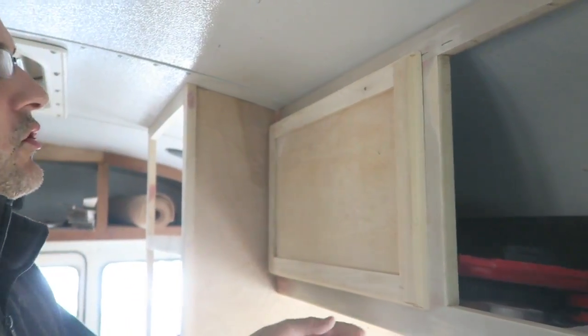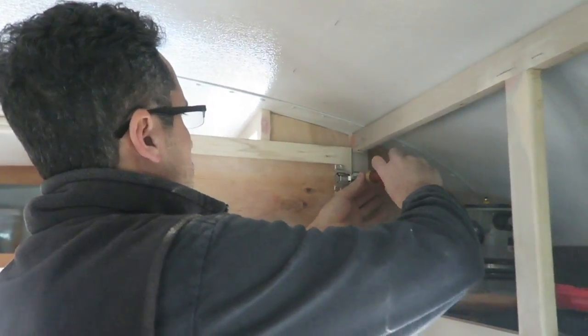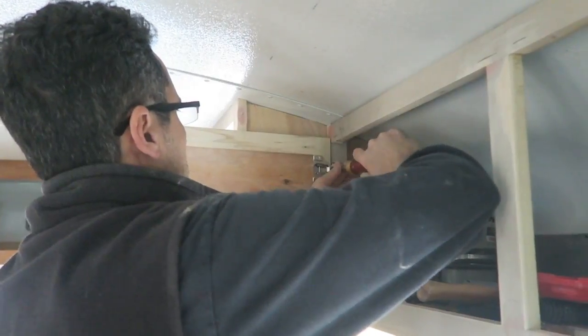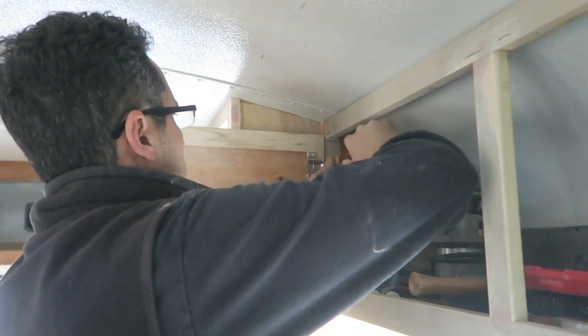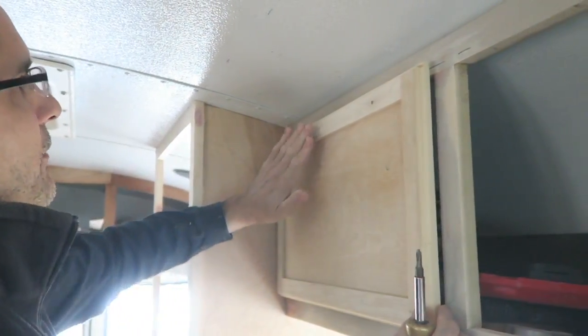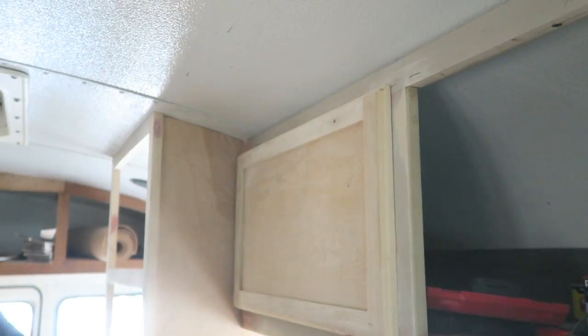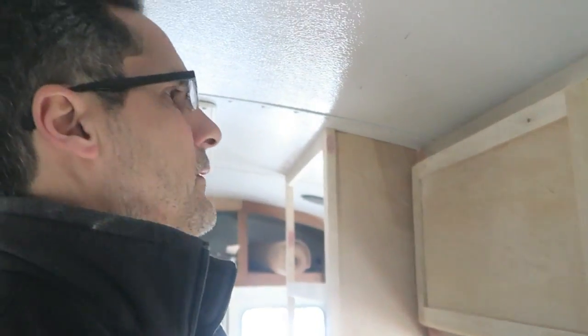The second screw I showed you, I said push the hinge. It might not be enough in this one adjustment. I'm pushing the top of the door that way, so when it's like this, I'm pushing the top of the door that way. Makes it tilt downhill. Got it? I kind of got it.